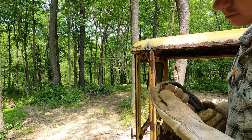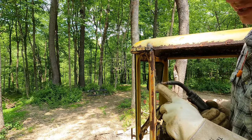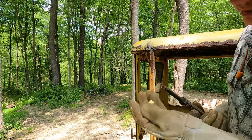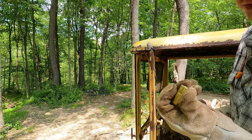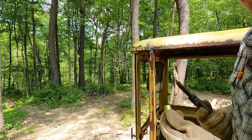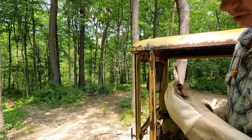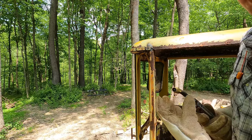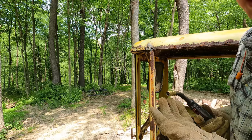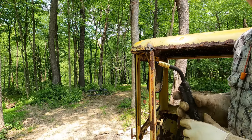In our case, we don't have a shielding gas coming out. All we have is this wire, and what's actually on the inside of that wire, you wouldn't be able to see it, is a core that's filled with some sort of material. I'm not exactly sure what's in flux core wire, but it acts as a shield. I think when it burns, it produces a gas in place of our shielding gas coming out of the gun, and that protects the molten weld puddle. So this is kind of an all-in-one deal.